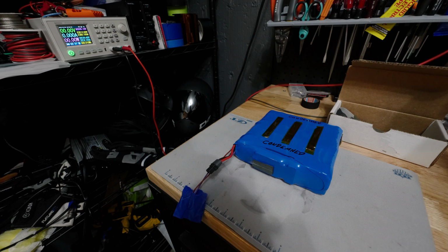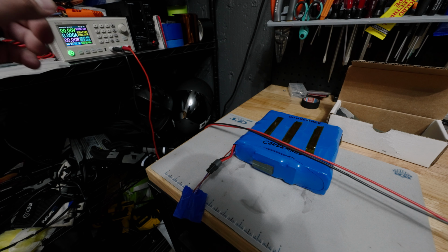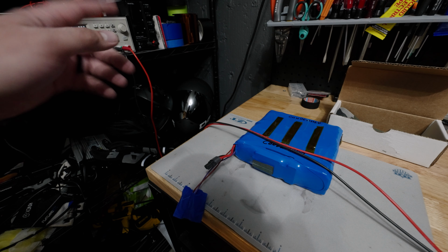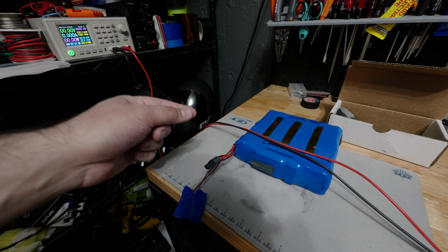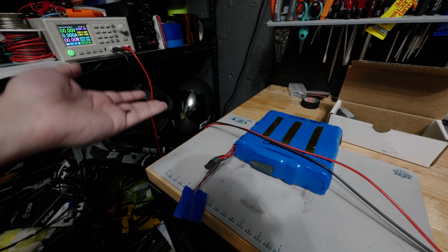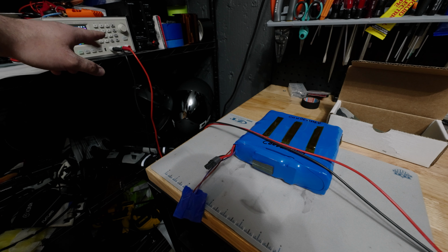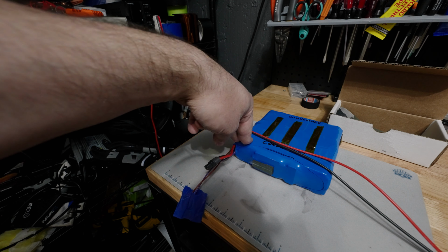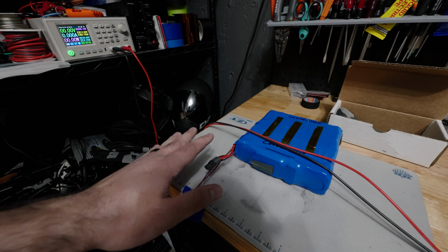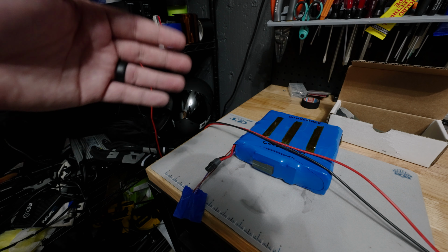So we have the power supply set to a voltage that is higher than this current pack. Now, I am not going to bother setting the power supply to the total high full voltage of this battery because we are not going to charge it through the main terminals the entire way. We are going to charge it roughly about halfway at a very, very slow charge rate. So if you're not entirely versed with this and you see your device has a charger that outputs 3 amps, 6 amps, 10 amps, we are going far, far, far below that. This is currently set to about 100 milliamps, so that's 0.1 amps, and this is a 4P pack. So this is about 25 milliamps per cell. And even that is a pretty fast charge rate for recovering or reviving a dead lithium-ion battery pack. Quite frankly, it should probably be closer to half that, like 10 milliamps per cell.